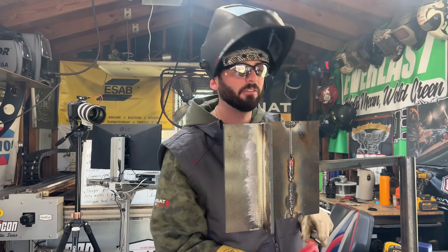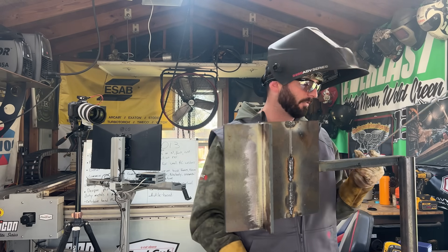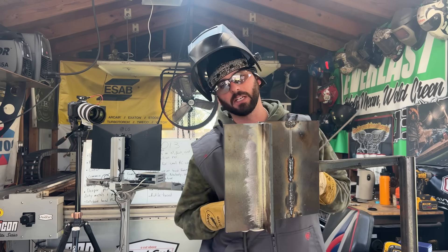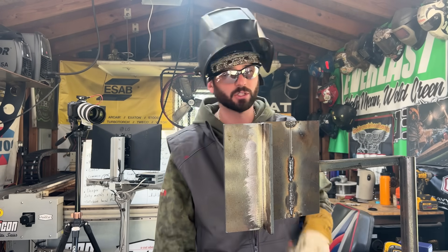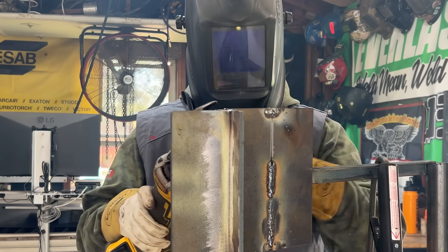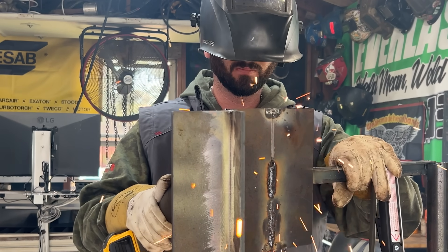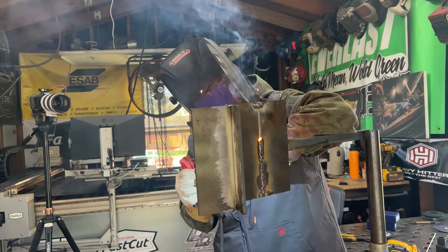It's definitely digging and breaking down - that's the whole point. Now the only difference I'm going to make is switch to a 6013 electrode. I'm going to change no amperage settings, still 80 amps, and we're just going to try to finish it. Still going to feather it. Much more sluggish. Got a big hole to fill right here, which the 6013 made pretty easy work of.